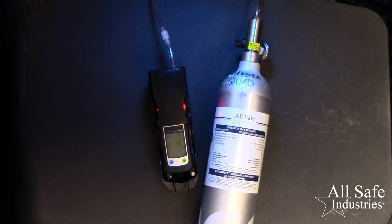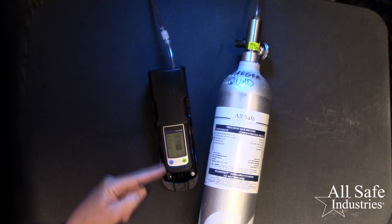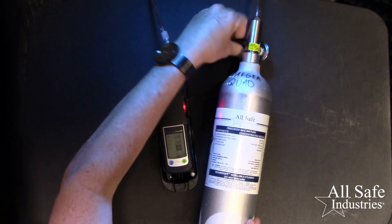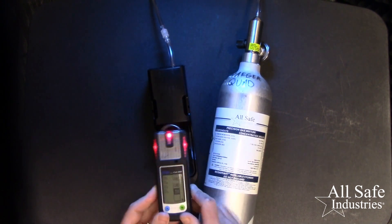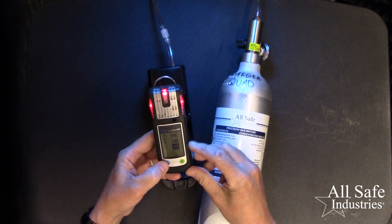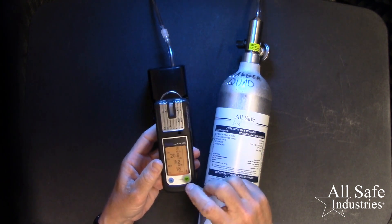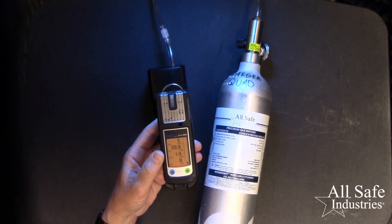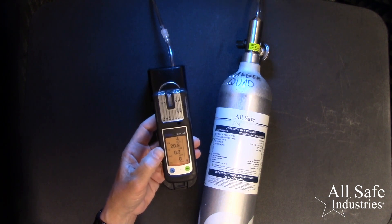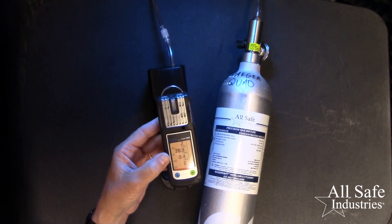Watch for the sensors to react to the gas. Once you hear that beep and you see that all the sensors say OK, the sensors have reached full scale and the calibration is complete. Turn off your calibration gas and release the meter from the calibration cradle. Hit the blue button just to advance past the last calibration menu. The sensors are still reacting to gas, so press the OK button to silence those alarms. Then watch the sensors drift back down to zero except for oxygen, which will say 20.9%. This completes the full calibration on your Draeger XAM series gas meter.